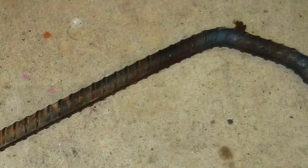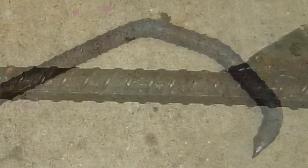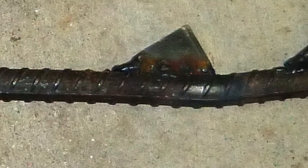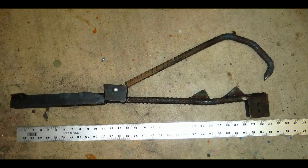I took my two pieces of three-quarter inch rebar, sharpened the end of one piece and bent it using a blowtorch. The other piece I left essentially straight and affixed some spikes on it. I also added two ears for an optional attachment of the foot. On the other end of the straight piece of rebar, I welded two more ears. This is where the movable arm — the one with the sharpened end — is attached. Here is the assembled Peavey without the foot attached.